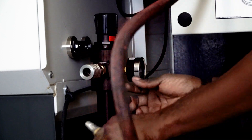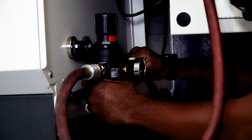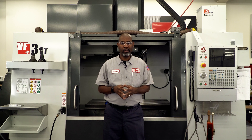If you're experiencing these high air warnings, the simplest way to correct the problem is to add a regulator to the airline coming into the machine. If you're operating several machines, it is necessary to add a regulator to each machine and set the regulator pressure to the middle of its range at 100 psi. With the regulator installed, the safety valve problem is resolved.